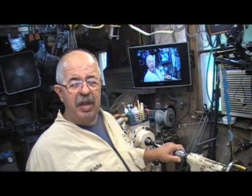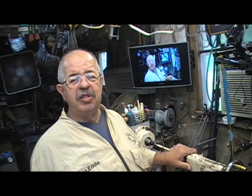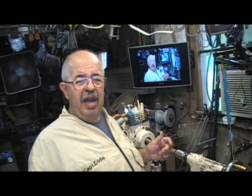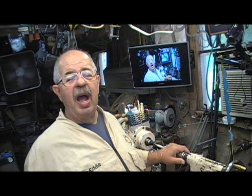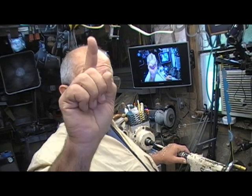One of the things I got from the tips package — guys sending me in ideas — is let's drop the nut. We're talking about this little nut that you use on the end of your pen mandrel to tighten it up. Let's get rid of it. They do make parts, centers that do this. But do you have a revolving center for your lathe? If you've got a revolving center, I'm going to show you how to make one. It's real simple — all you got to do is watch.